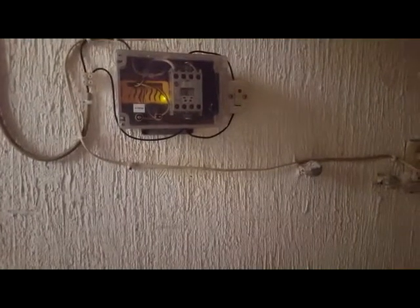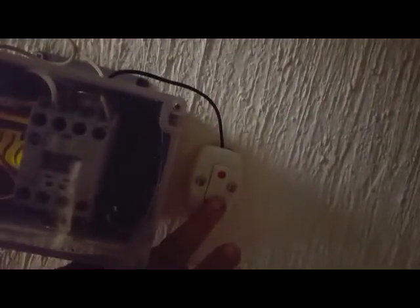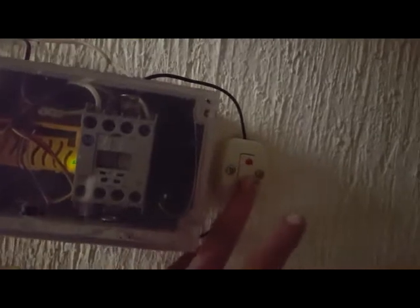And what this does, it will try a DNS search and ping Google, Facebook, Yahoo, Microsoft, and other websites. That means if there is a DNS connection, there is internet connection. If I can ping those websites, it means there's Wi-Fi connection. And this here is a bypass switch in case I have someone come in and do something. It can bypass the whole system, so it will always be on, but it will not be enabled when I'm away. That's the reason why I want the systems to be rebooted in case there's no Wi-Fi connection. And it's gonna be done like the first of the month, the 8th.